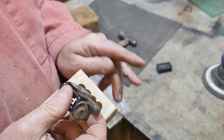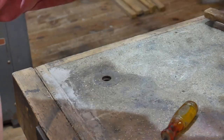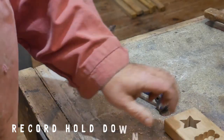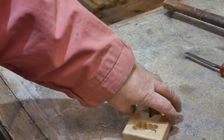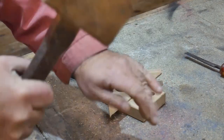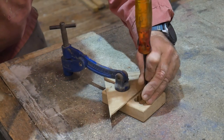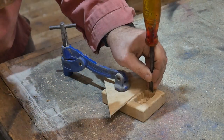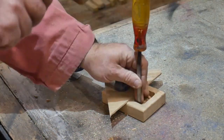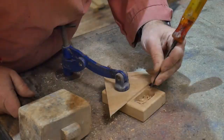That tool there is a corner chisel - a Trend corner chisel. But you can't use it yet. We're going to use this record hold-down to hold down the block of wood with a star cut in it and a series of round holes - not all the way through. It's a mallet, not a hammer. Because we use mallets with chisels - you get more control. Because we've got all these little points from the radius of the forstner bit, we've got to remove them first. So we're going to use a small chisel to cut them away.